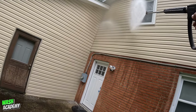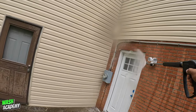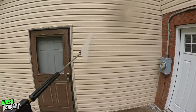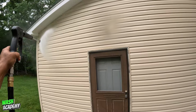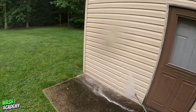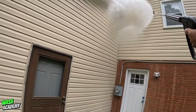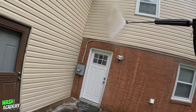Remember when you are rinsing, guys, top to bottom. So the opposite of the soap phase, we've said this already a lot in the downstreaming series. When you're soaping it up, it's from ground to gutter. And then when you're rinsing, it's the other way around. So you want to start from the top and have all of that debris flow from the top all the way down to the bottom.